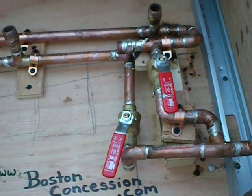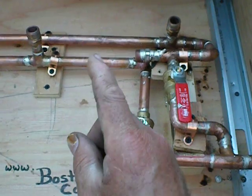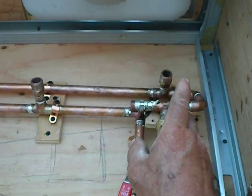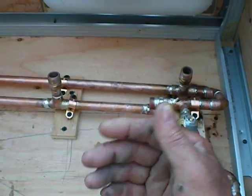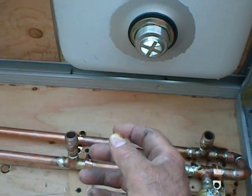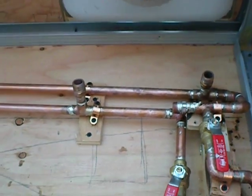What we would also recommend, and we offer, would be to add a second lever for circulating the hot water from the water that's in the lines into your holding tank for fresh water for a moment or two until you know that hot water has arrived at the sink. Then close that, open up the sink, and you'll not waste all of the water every time you wash your hands all day long. You'll be surprised how much that adds up.